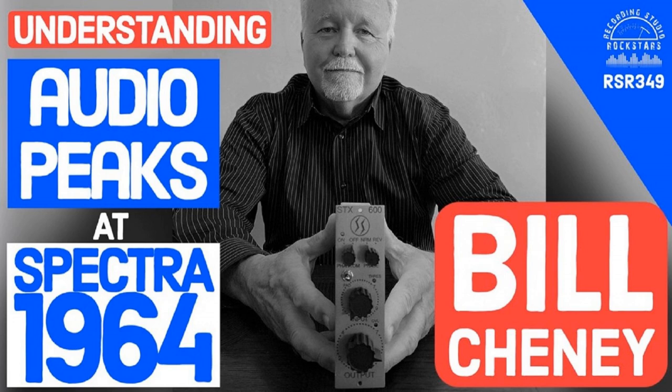The hardest thing to explain when they brought the company back to life was: we're not limiting any music. We're limiting just the transient voltages that come with the instrument — like a hot pickup on a guitar, easily 20 dB of voltage spikes right in front of the waveform. What happens is the amplifier tries to reproduce that peak. If it doesn't have the wherewithal to reproduce it, any number of things happen — distortion, loss of harmonics, you have to turn it down, and then you're more into the noise floor.